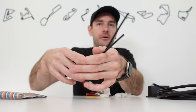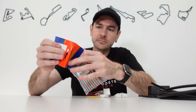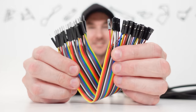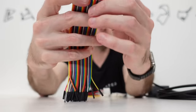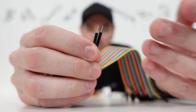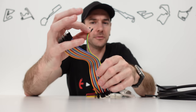Depending on the push button you use and the LED inside it will determine what voltage you need. There is a header on the motherboard that does output a voltage for the LED, but that's generally only five volts and low current, so I recommend taking the power from the power supply itself rather than directly off the motherboard. We've got a length of heat shrink here to insulate the wires, and we'll be soldering everything today. And then last but not least, we're going to be using this little jumper lead pack to connect to our motherboard header for the power switch — we'll use two wires, which we can tear off and strip.